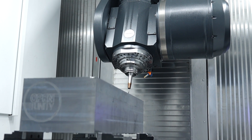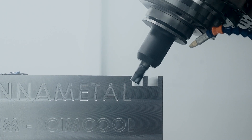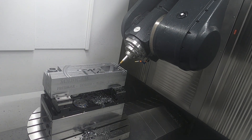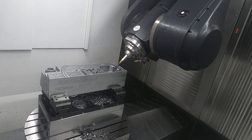You were using really heavy milling with some fine finishing as well. When you do heavy roughing, normally you would take it onto a different kind of machine to do the fine finishing. How would you suggest your customers attack a component like this? When you have the right balance between the performance of the machine and the design, you can do roughing and finishing. We were making some big chips to show customers and visitors that the machine is able to make big chips. In the other cutting trials, you have seen that we can also do fine milling operations to achieve very good surface roughness.